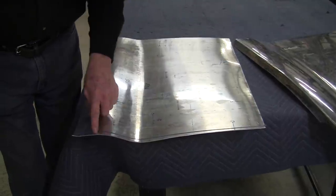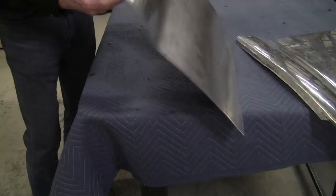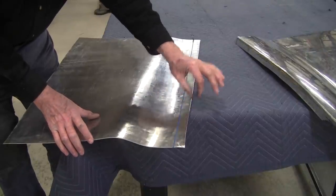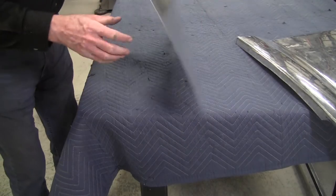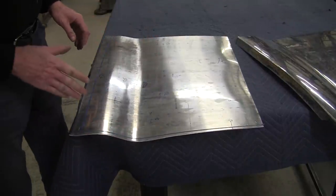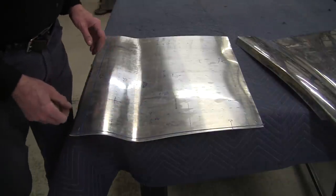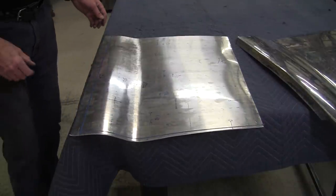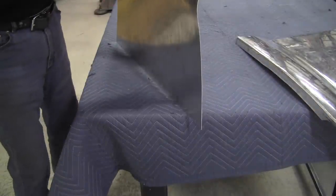So I generated that line, and also this is the tip line here where that outer flange is going to go. And then I measured, and using a divider, marked it off here, and I have where I'm going to tip this. So we're going to cut first. We'll do a precision cut with the cordless shear, but we'll leave ourselves a little cheat room, and we'll grind it in with a little air grinder. That will get the line perfect right on the blue tape. After we get that cut, then we will do the tipping here.